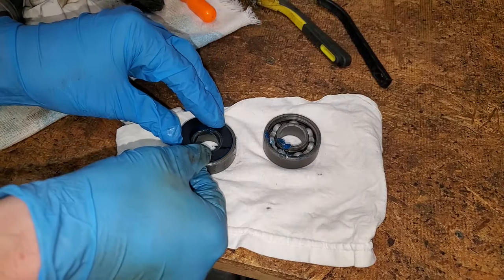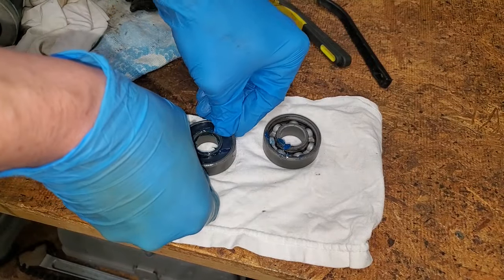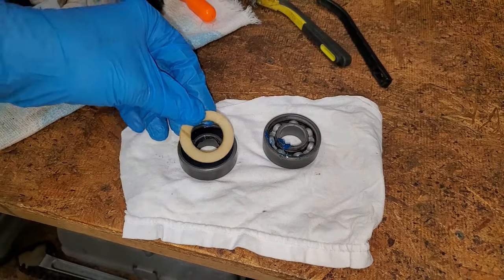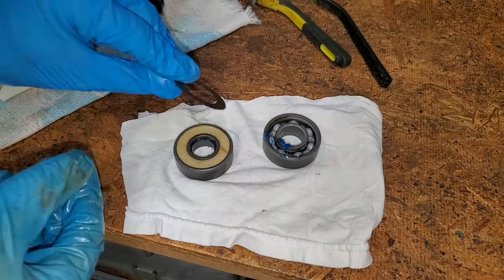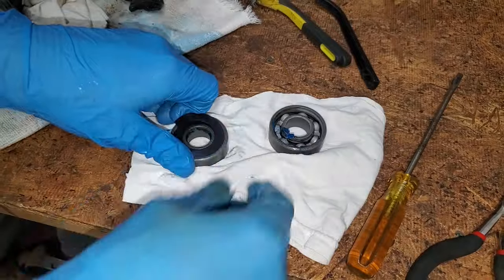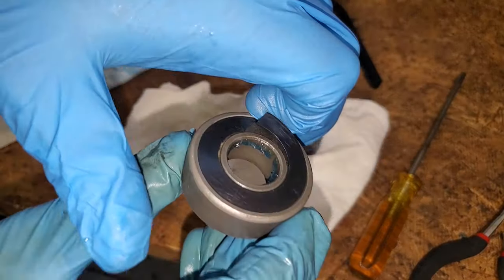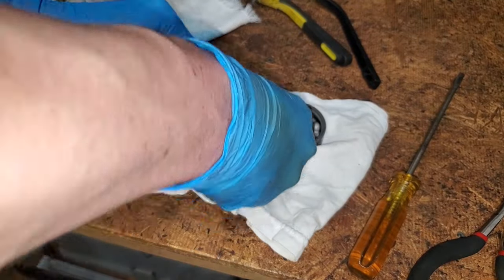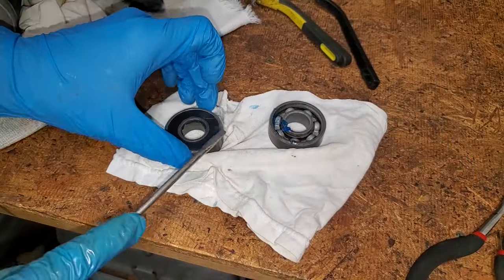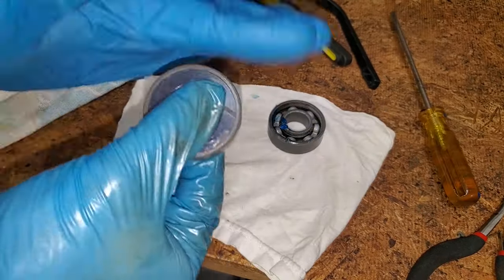Reassembling the bearing shield was pretty straightforward, except for the final metal disc. I figured out that I had to start by pushing one end down into the bearing while prying up on the other end. It rolls smooth and quiet.